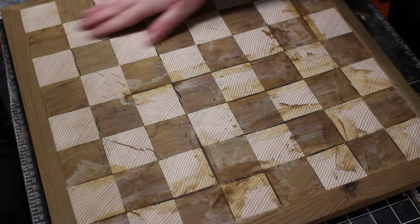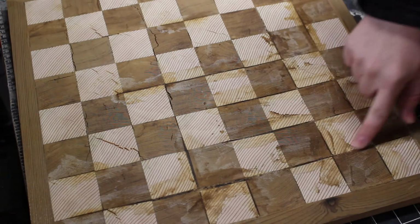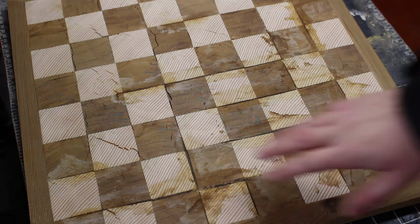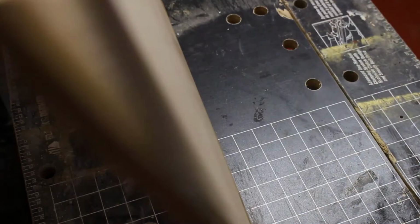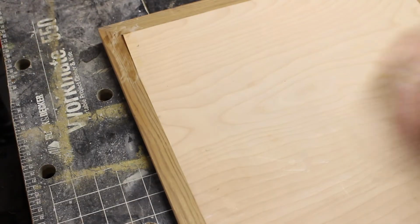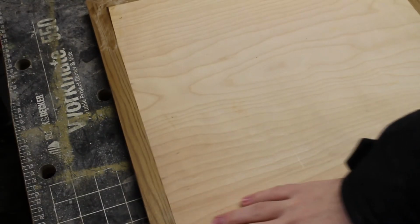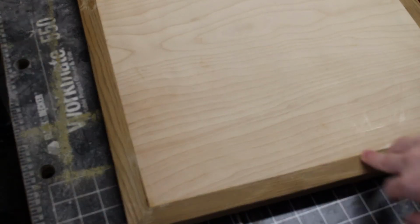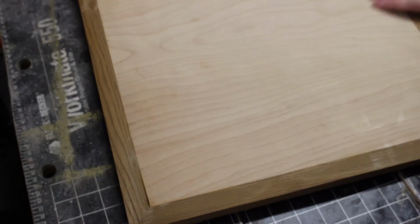And so the cracks in the wood look good. I find that the cracks over here sort of didn't look so good, and you can see that I've gotten some wood filler. Also, I sanded down these sides, and I used a Christmas gift, a handheld belt sander, mind you, to flatten down these pieces of wood here on the sides because they weren't quite flat when I put them on. So the bottom's basically done.